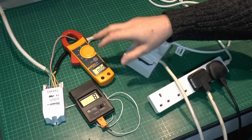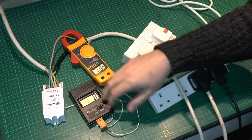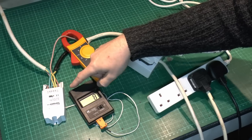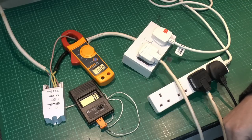We're using this clamp meter because the other meter we've got only goes up to 10 or 15A, so obviously no good for 16A and above. This is a temperature monitor, and I've just shoved it through the hole here and taped the thermocouple sensor directly onto the circuit board where the track is for the current going through the relay, so we should see that increase as current goes through.